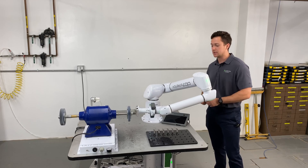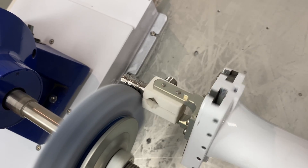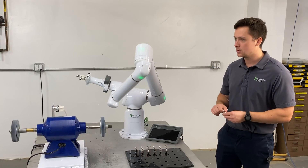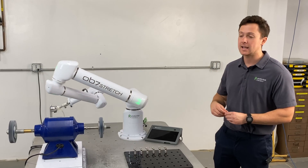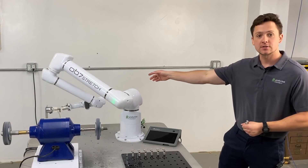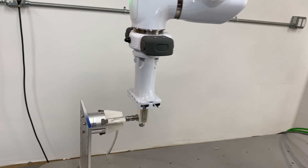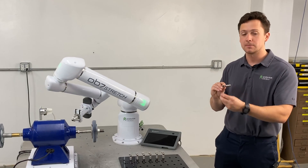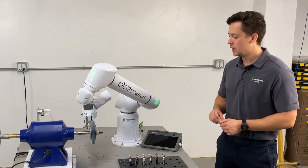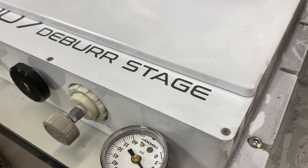This pass is going to repeat a couple of times. With your J7 axis you have plus or minus 540 degrees of rotation, so you can rotate 1080 degrees — quite a few spins across the wheel. You can see it taking the part over to the regrip station, which again allows us to change how we grasp the part and perform the second operation on this L-shaped part — doing those threads on the other end. You can see how the motor moves just a touch to allow consistent pressure onto the part as we deburr it.